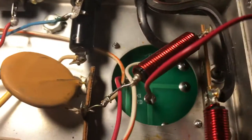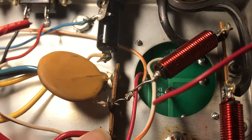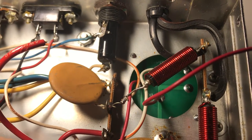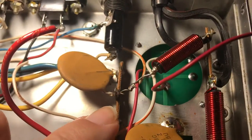Let's find out where that is here. Looks like this red wire is one of them. Yeah, they have two red wires here. So you can connect the transformer — connect one there. Put two red wires from the high voltage board on these lugs and reuse the lugs right here.